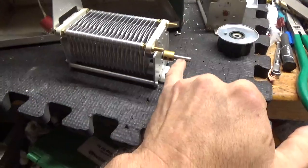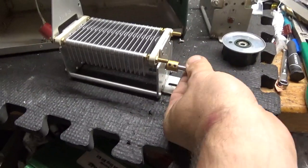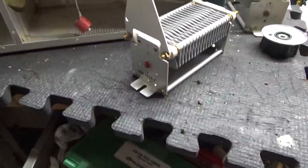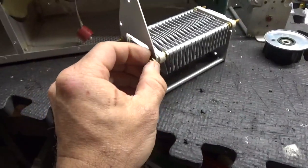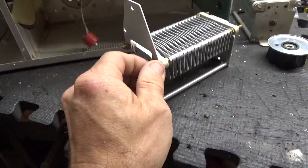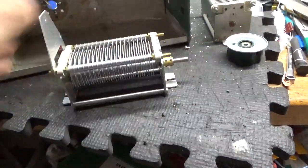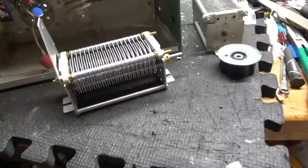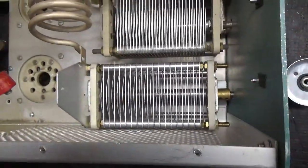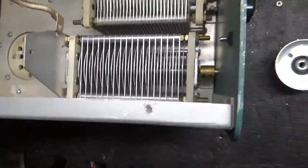I got a piece of shaft material, coupled with a quarter-inch shaft coupler. I enlarged the holes on the bracket — stock bracket. These brass nuts are just on here temporarily. You'd want to add some internal tooth crush washers. I'll temporarily mount it in there so you can see what it looks like. It's installed — nice and clean, looks like the stock one, other than the shaft coupler.